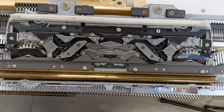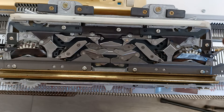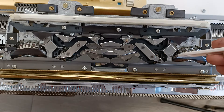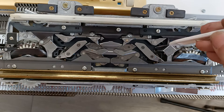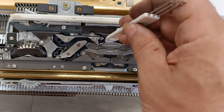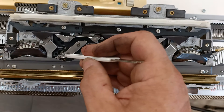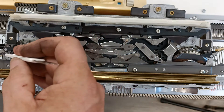The first thing to do is look at a knitting machine when it is just knitting normally. We're going to follow the path of a needle. You can see that this particular thing at the far right hand end of the picture is flipped up, which means the needles coming in get pushed down and they totally ignore the drum that's programmed. The path of the needle from there is it gets pushed forward to here where it picks up a stitch, gets pushed backwards a little bit just to pull the stitch through, then gets pulled down which pulls the stitch right the way through, and the needle exits with a new stitch formed.